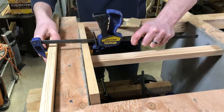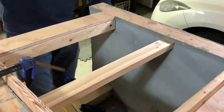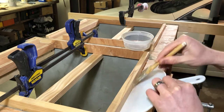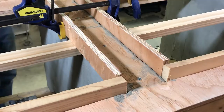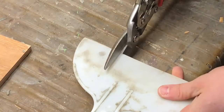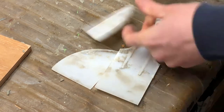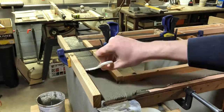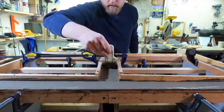For the front of this thing, I wanted nice clean edges and didn't want to slop anything on all the work I had just done. So I made a form using scraps of plywood and anything else I had laying around. Off camera, I cut everything to exact lengths and mixed in some mineral oil, applying it to the sides of the form to keep the concrete from sticking — which I would remove once the concrete was applied. Then I took a plastic scraper and cut it down to 2½ inches so it would fit just right inside the form. These two changes made applying the concrete to the front surface a lot smoother.